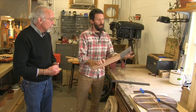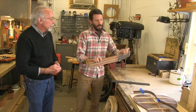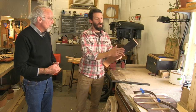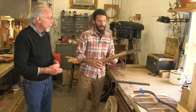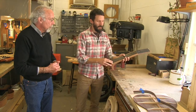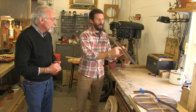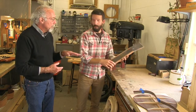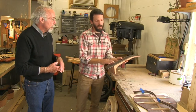They're both laminated wood. This rear laminate is more of an arch top guitar construction, but it's something that I adopted. And then it all gets sanded and shaped down to the same size as the fretboard. This one's been slotted already and has binding of the same material on the edge. And the fretboard is rosewood? On this one, it's ebony. And a dovetail joint.